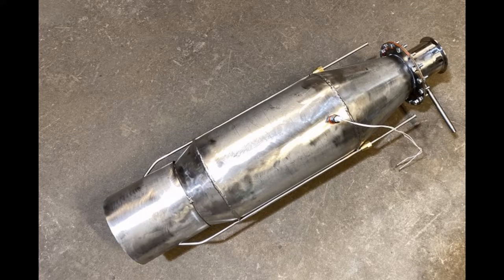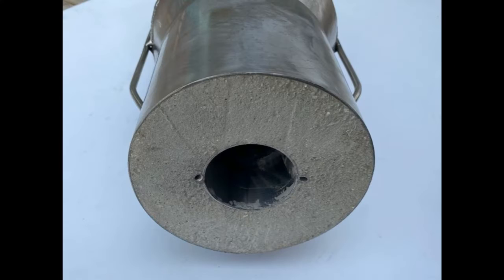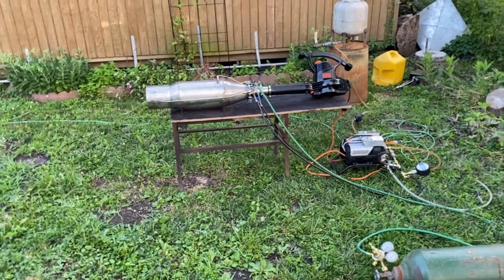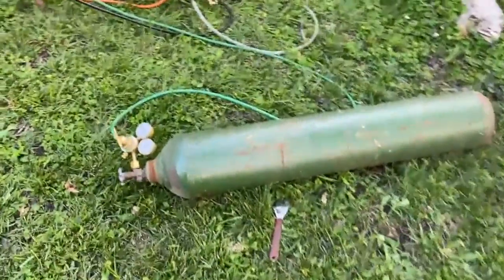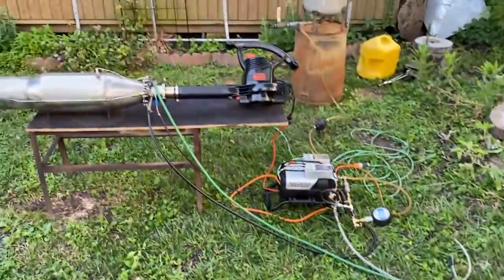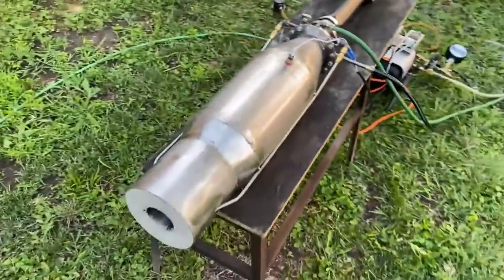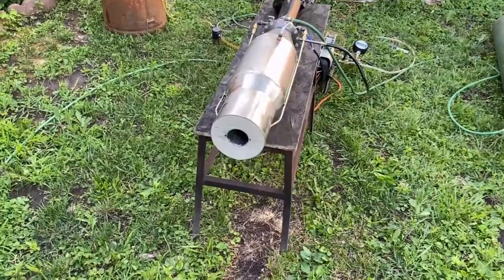The preceding data acquisition will be used to determine any modifications needed before this rocket burner ships out to the customer. What we're looking at here is a surface mix oxygen burner that has two oxygen lances facing at a 45 degree angle, pinging about three inches in front of the nozzle. We're back out here at White Sands Proving Grounds with a special custom build for Thomas — he's going to be smelting a large amount of cast iron, so we have a very large rocket burner here.